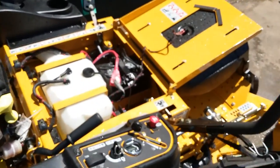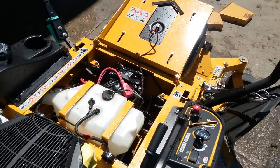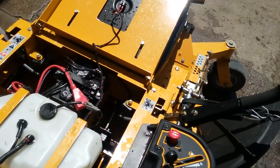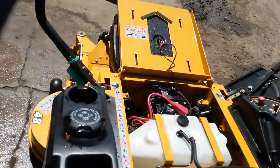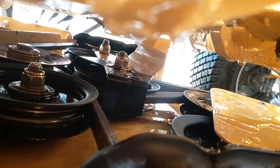So those are two safety switch compliant things that we have to go over. Another thing that your Hustler dealers should do is make sure that the belt guide update is on. The belt guide update is on the deck. These have a bad habit of throwing belts from about the center of the deck. If you look right in the middle, there's a black plate — it kind of looks like a Y or an elongated Y. That needs to be installed. That's a big thing.